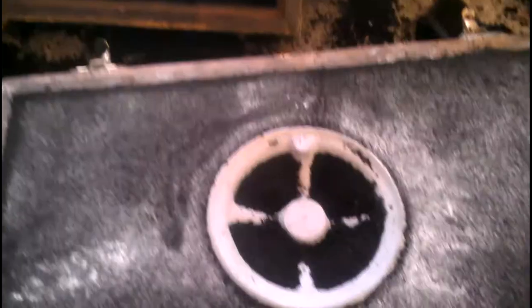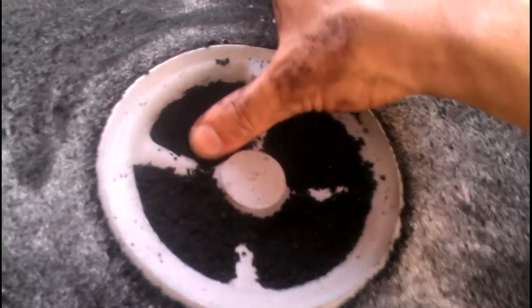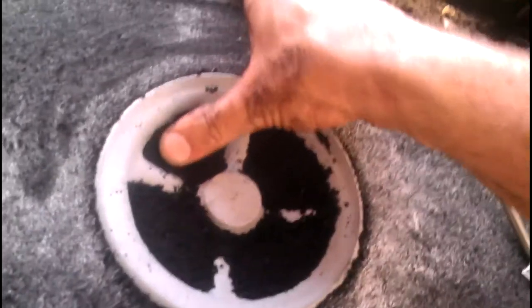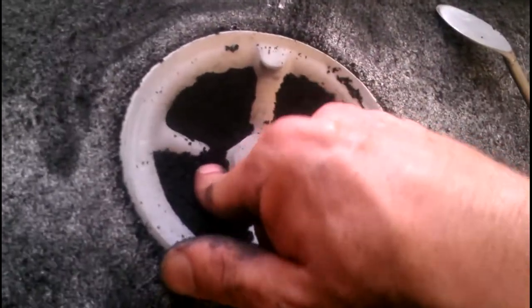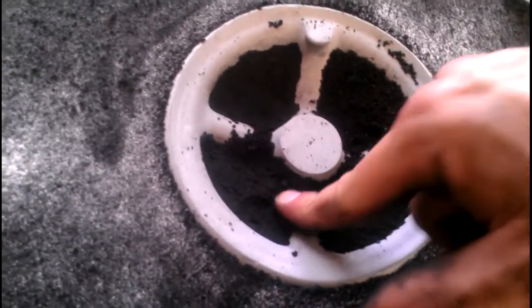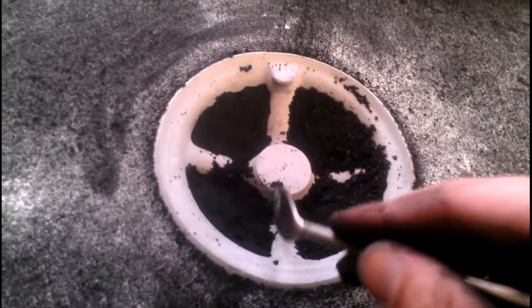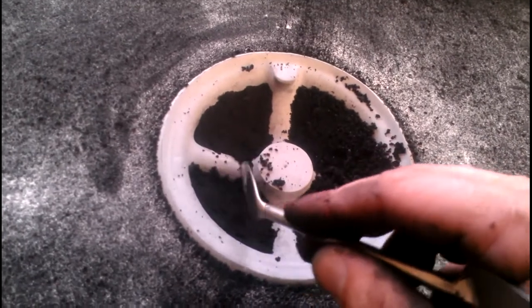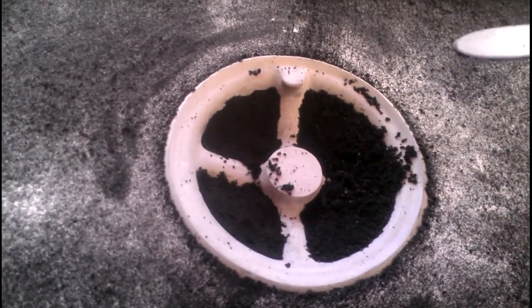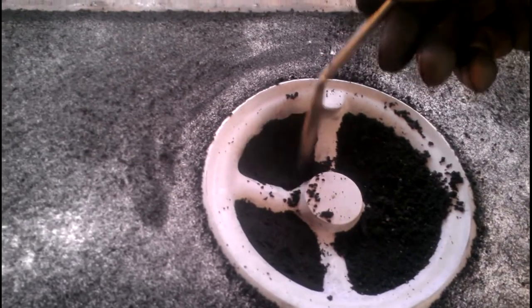What I want to do right now is pack this sand in here and make sure it's really good and firm — that'll make it easier to cut out and should leave a good line. I'll use the old trusty finger to pack this sand in. You can use a little bellows — I think he's got one around here — or compressed air works pretty good for blowing the sand out.